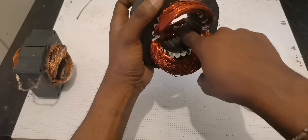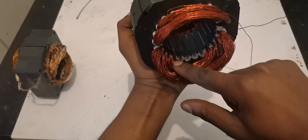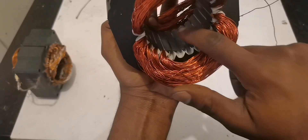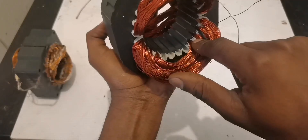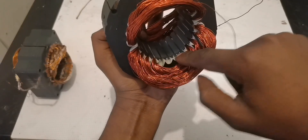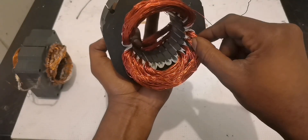The starting point is at the middle — the small wire starts going this way. We go 100 turns from here to there. At the middle there are four groups — one, two, three, four — which we didn't use. But group five going this side: 100 turns. Then the next one, same direction, another 100 turns. Same thing for the third and fourth, all going the same direction, 100 turns each.